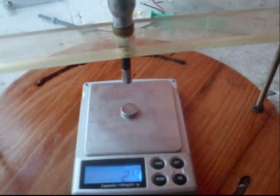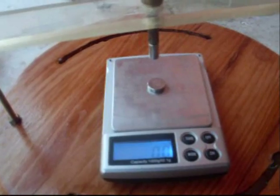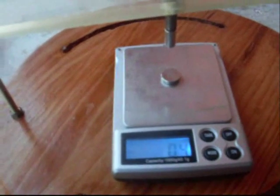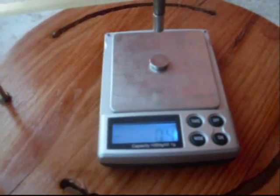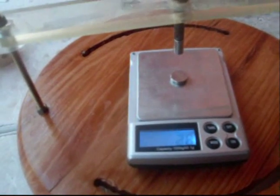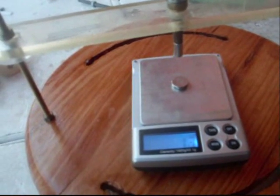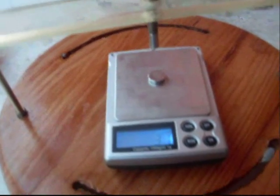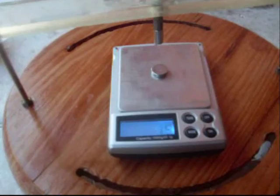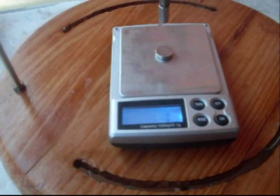From here on in, if you know the force of attraction and you can draw up a graph, and if you know the force of repulsion between the two magnets, you can draw up another graph. You'll notice there will be big differences between the two — attraction is by no means as weak as repulsion. Repulsion is quite considerably weaker, because as magnets approach each other in repulsion they move down their BH curves, so the force of the magnet goes down. In attraction it generally creeps up because it moves further up the BH scale. But that's for another day — I'm interested in finding figures for big magnets against small magnets.